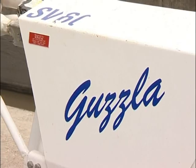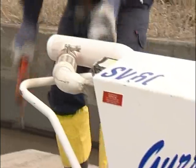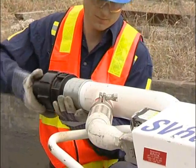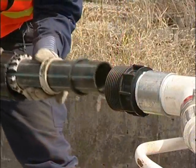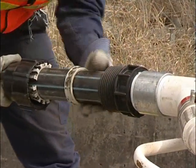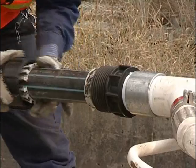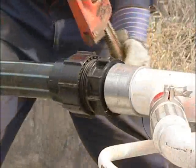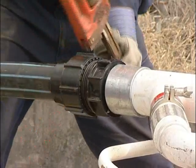You then need to connect the discharge line. The SV60 and SV60V can utilize a wide range of pump lines. These include polypipe, rubber braid hose, and lightweight steel pipe. Ensure the correctly rated discharge line is used. Lay flat hose is not recommended.